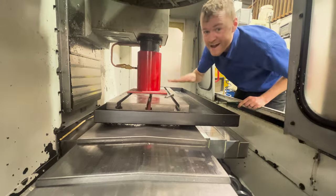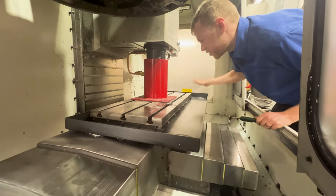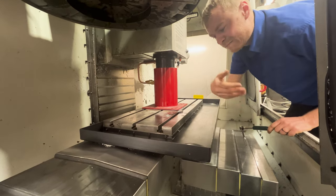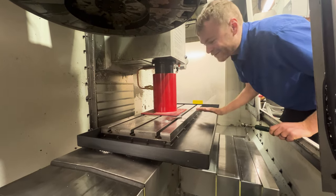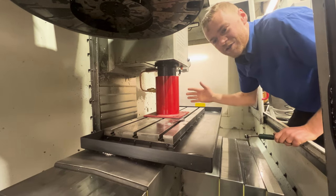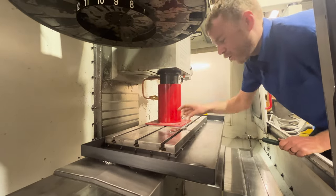You need to bolt the head down to the table via a bolt and bracket or some type of way, because you don't want the table sloshing back and forth and the spindle falling and damaging the ball screws or the table or bending something up. I've got some secret plans for this machine — you'll find out later what they are and maybe what I paid for it. But this isn't ideal, so do a better job if you're going to rig a machine home. This will work — we're not going super far.